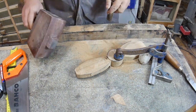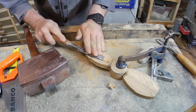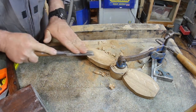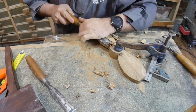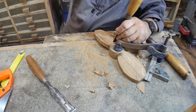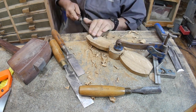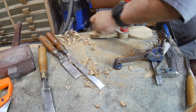Now I'm using a gouge chisel to go around the shape of the hub. You could use other things — a straight chisel or just a knife. Now I'm using a flat chisel, a Robert Sorby chisel, just to pare away the excess material. I soon get bored of that and decide to use something different — a Draper chisel, and then actually a brad pairing chisel which works a lot better because it's thinner and longer and gives you more control.